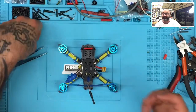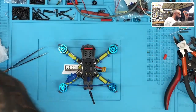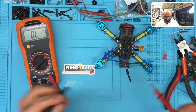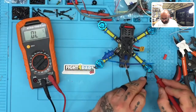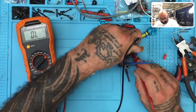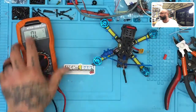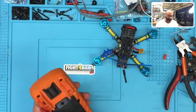With that done we basically have a completed quad — capacitor on one side, XT30 on the other, motors, and fasteners, everything set up properly. Now we need to test it. First thing you do is a continuity test — get your multimeter, turn to continuity testing, and you'll hear a beep confirming a connection. Touch ground to ground — beep — and ground to positive — nothing. That's the first step to make sure you don't damage your setup.